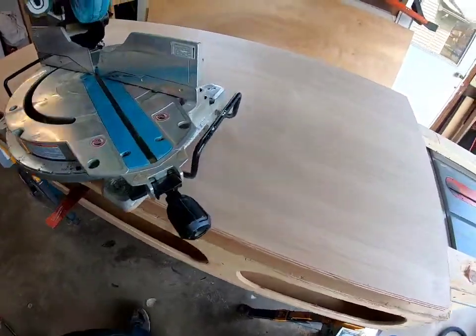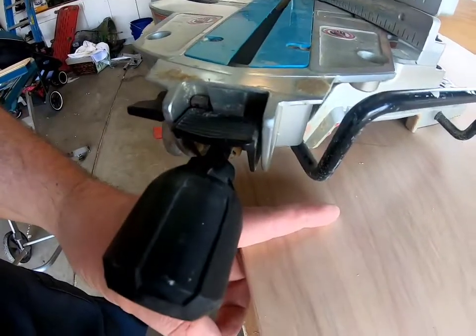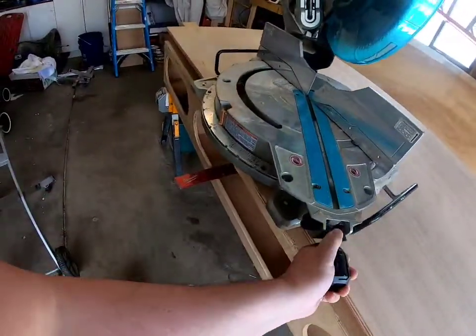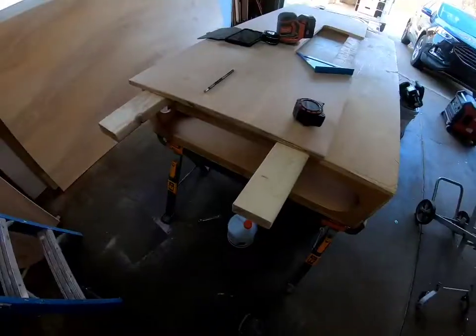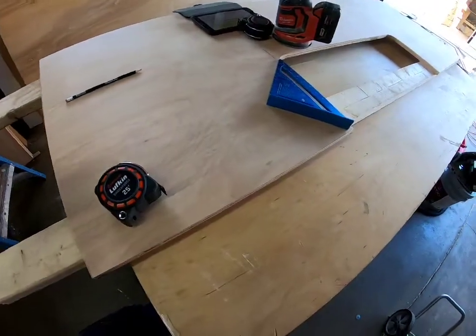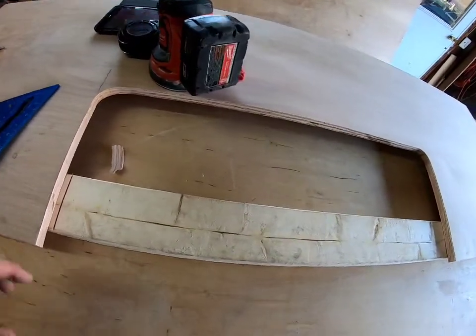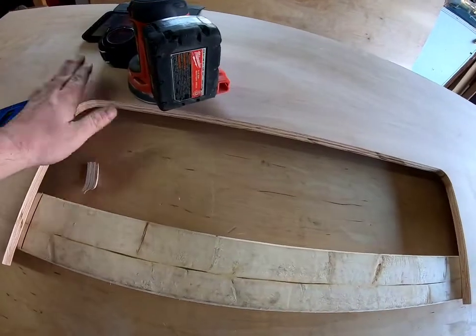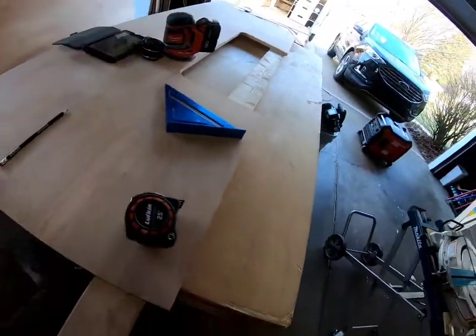I want to bring it out so the board can have the cutout about right there, and I can always notch it even more — I can probably just go straight at an angle here, and then these come straight at an angle going both ways. We don't want to measure sixteen times and cut once. All right, so I got the top part cut out. This is cut out for my specific saw — the plans call for a different tool but mine's a little shorter, so I don't need as much room, which means I have extra support and extra wood on the actual table.